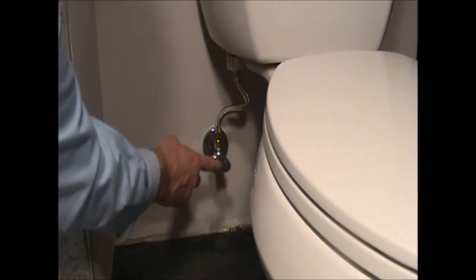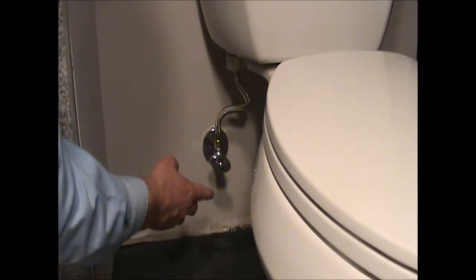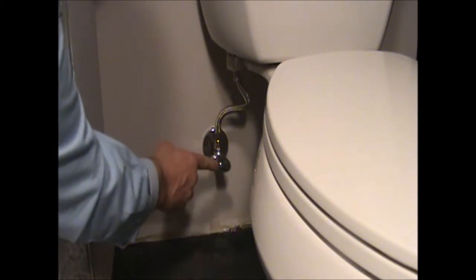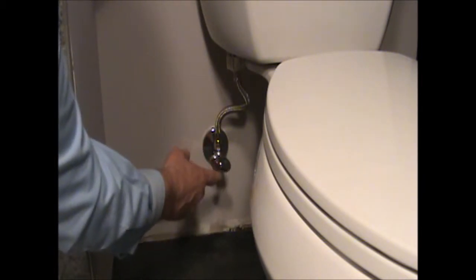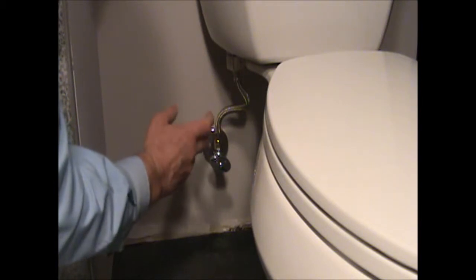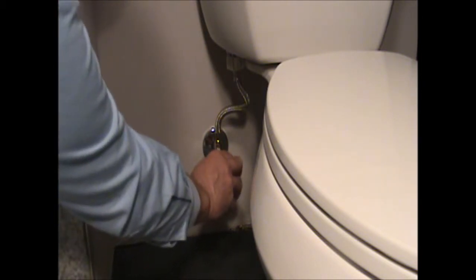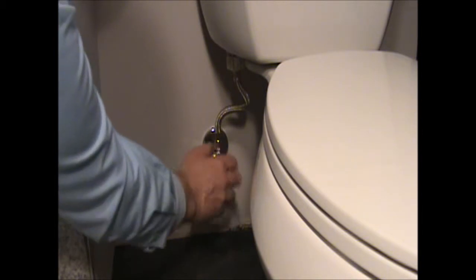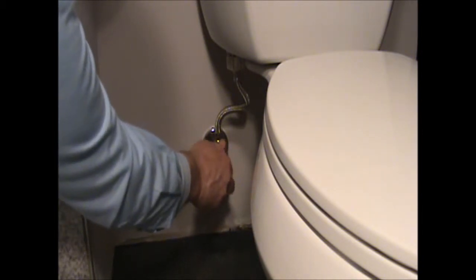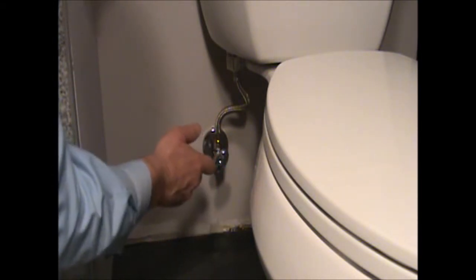Here we are at an interior shutoff on a toilet, but this is the same type of shutoff you'll find underneath your kitchen sink, bathroom sinks, and all the toilets in the home. You'll have a valve — a keyway — with typically an oval handle, sometimes round. Newer ones are just a quarter-turn lever, similar to a gas valve. These older style valves are a screw or gate type — just turn until shut off. Don't crank it down hard; get it snug and leave it, because over-tightening the seat can cause it to leak over time.